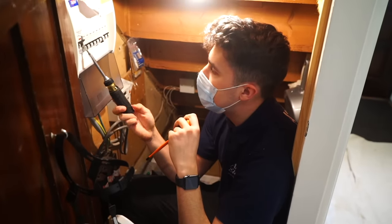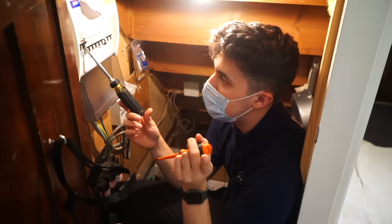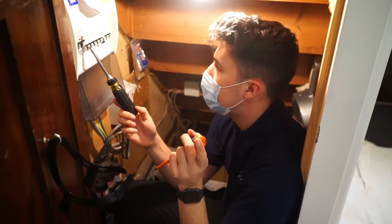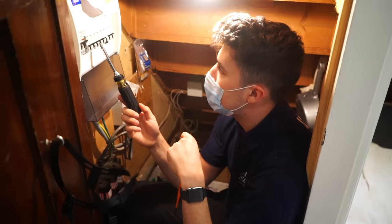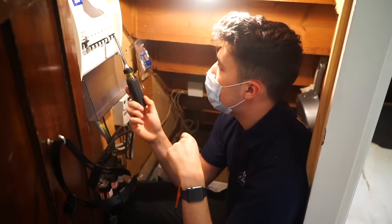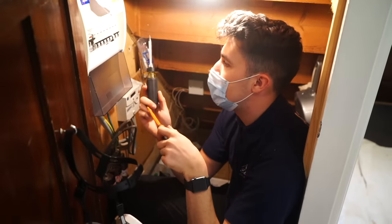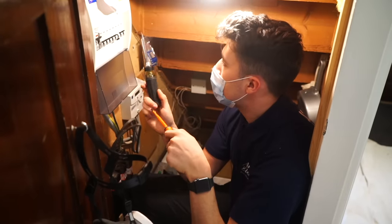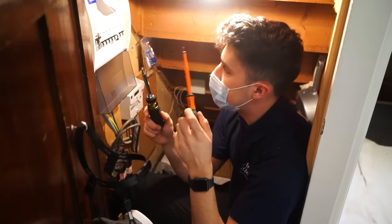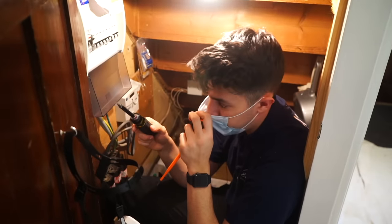The cooker is on a 50 amp breaker, but I've just looked at the rating on the cooker, and it's only a 15 amp cooker. So we're going to drop that to a 20 amp as well. So it's going to be a very European board. 20, 20, 20, 20, 20, and I'd like to make them 10s, because that's what the Europeans tend to do, just 10 and 20 amp radials, and 6 amp RCBOs. And the outside power we're going to put on its own circuit.